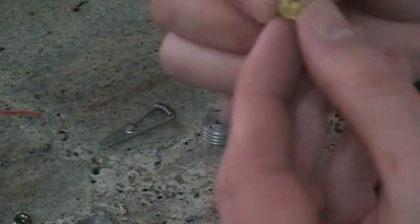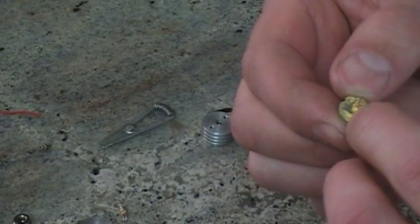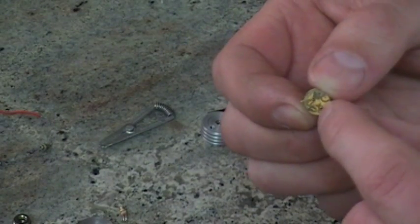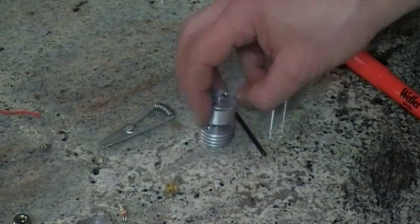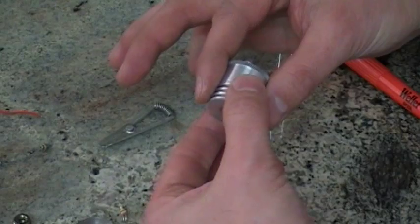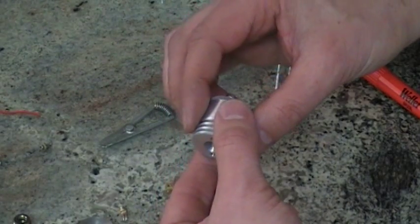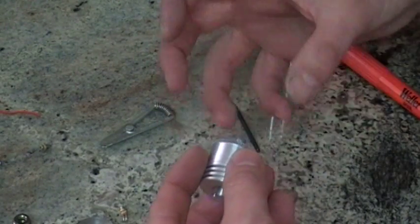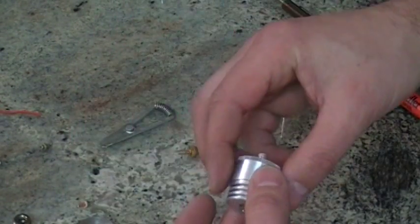The 808 diode — one of them has a little black ring around the pin, which is your negative. The other pin touches the case, so that one is case positive. If you use a case-positive diode, you need to wrap tape around it where the heat sink contacts the case, because the case acts as a ground and can damage the diode or lower your amperage. Isolate it with rubber insulation from the rest of your project. The 445s are case negative.